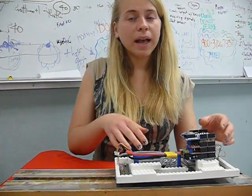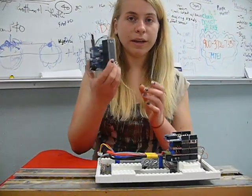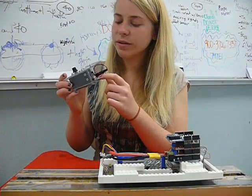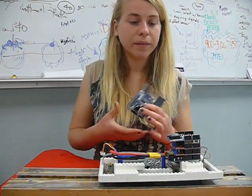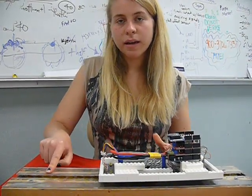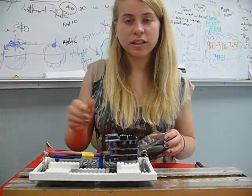The train has an Arduino Uno board, two SparkFun motor driver shields, a wireless shield, and an XBee radio to communicate wirelessly with the remote. The remote also has an Arduino Uno board, a wireless shield, an XBee radio, and an encoder which serves as a sort of gas pedal. The train counts how many magnets it has passed and uses that information to initiate electromagnetic braking so it doesn't crash into the end.